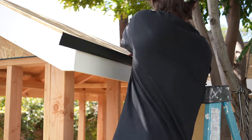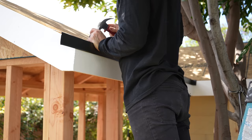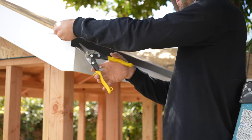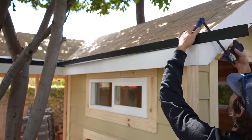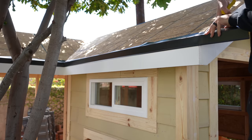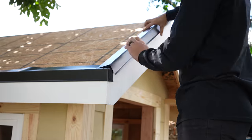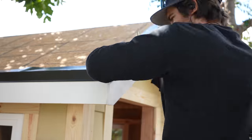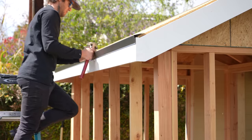When the paint was dry, I could put on the flashing. Just like all things with roofs and things on the outside of buildings, you start on the bottom and layer things on top as you work up the vertical. This roof is steeper than most, so it was a little difficult getting the flashing fully pressed into the edge of the roof. I made some cuts so the flashing wraps around the corners instead of just stopping at the edges. I continued adding flashing around the entire edge of the roof, making sure that any pieces on the slopes were layered on top of the pieces below it. The flashing here may not be perfect, but it looks good and will work great for this chicken coop.